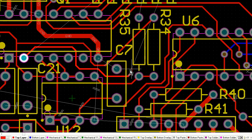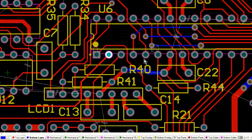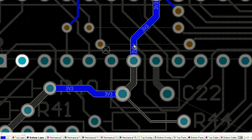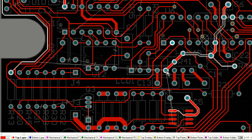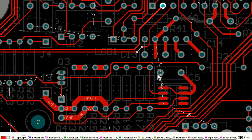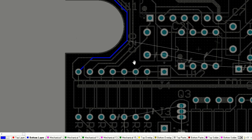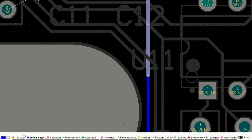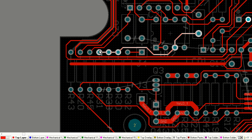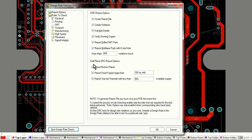points that aren't connected. Actually, circuit nets which aren't connected, and there might be a dozen or 2 left in there. So I'm now starting to lay out those, and I'm starting to connect the power now. I think the 3.3 volt rail, because what I would typically do when I'm laying out pretty much any board is do all the signals first, and then once you do that, you start work on the power rails. It depends though, on how power centric the power distribution is to that design. But in general, on a board like this anyway, I'm going to leave that power supply until later, and hopefully, if I've given it enough thought, and I've considered this when I'm laying out the board, either subconsciously or semi-consciously, I guess you could say, then the power shouldn't be too much of a struggle to actually route around the board. There we go.